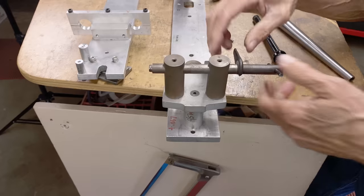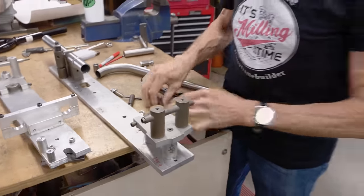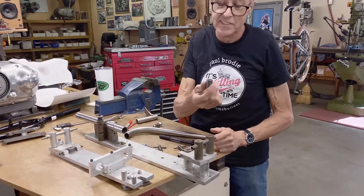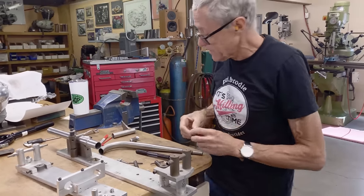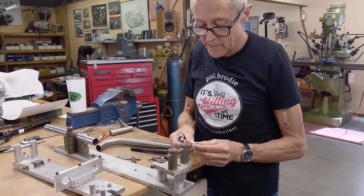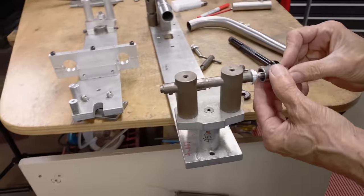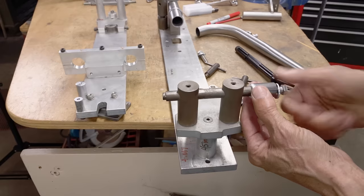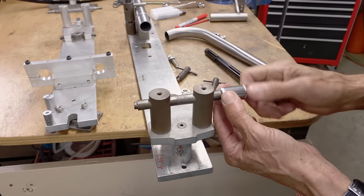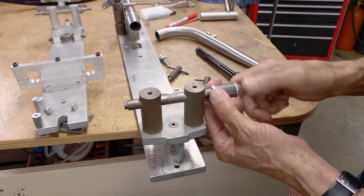This spacing is 100 millimeters. On the wheel that I have now, it's 110. We've got these inserts — I'll call these inserts, it's not really a dropout. What I did was make up this insert out of aluminum that fits onto here, and then I can put this on like that on each side. So the new spacing from side to side is 110 millimeters, which matches the hub.